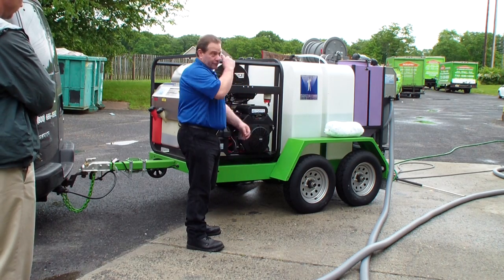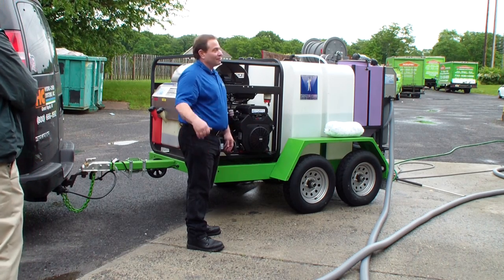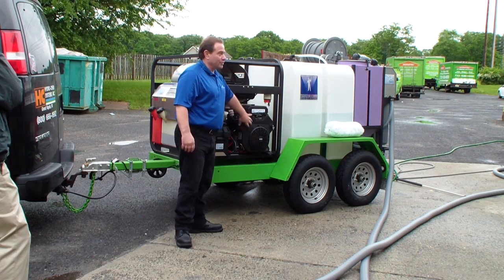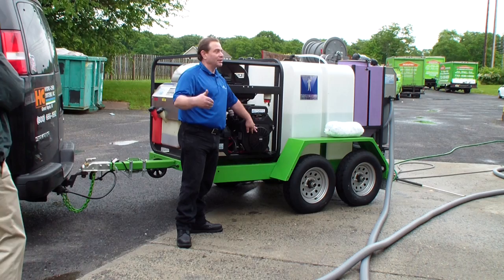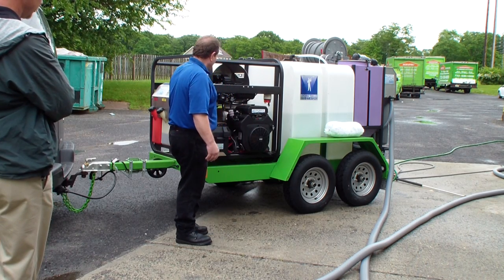We recommend every 50 hours. Typically, you can get from Michigan to Florida and back in around 50 hours. That's a lot of runtime for just a twin cylinder engine. It's also air cooled, which means they run at about 350 degrees Fahrenheit. So it's not like your typical 220 that your engine runs. So it's actually designed well.